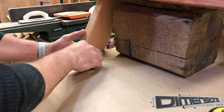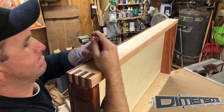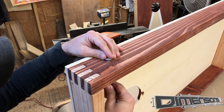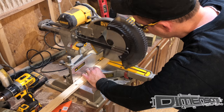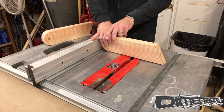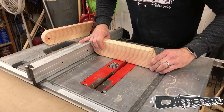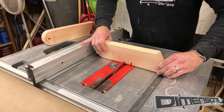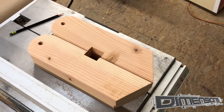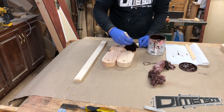Now it's time to find the appropriate angle for the leg. You can find this angle on some sites, but it's typically best to just raise it up 12 inches from the platform, let it hang over the edge of your workbench and mark it. I'm also going to run a small 1x2 between two legs so you can grab them at one point and pull them both out at once. Before anybody says anything, I realize this isn't the safest way to make this cut — I've built a crosscut sled for my table saw, but it was for my old table saw and I hadn't built one for this one yet. If you have a crosscut sled, I definitely recommend using it for this process.